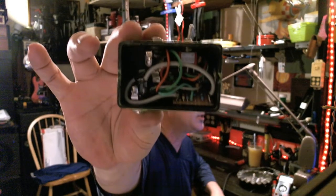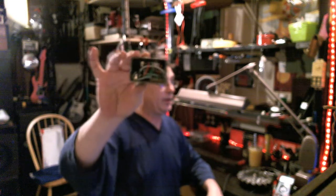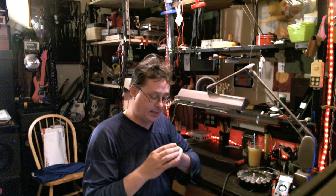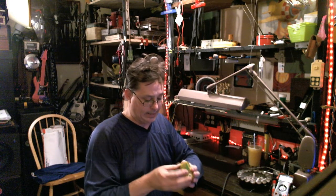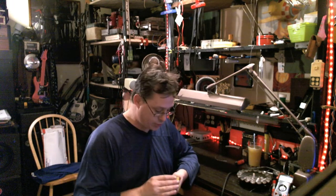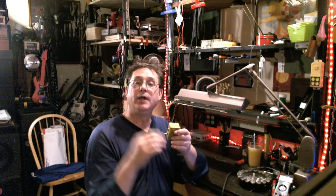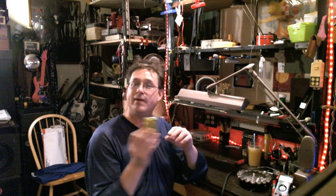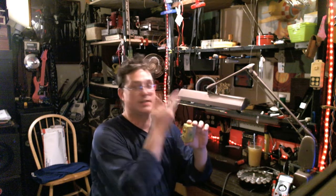Don't get those pins mixed up. It's just a handful of resistors and capacitors — the input and the output. With the input capacitor, that kind of sets the tone for this. So what I went ahead and did was install a switch with two capacitors, so I could choose from the normal, more full-range sound with a slightly larger capacitor, and then a smaller capacitor. When you hit that switch, it cuts a little bit of the bass frequency from passing through, so it simulates a little bit of brightness. And I found if you're running into any hum from fluorescent lights or a monitor, hitting that switch to the treble mode does quiet up that buzz significantly.